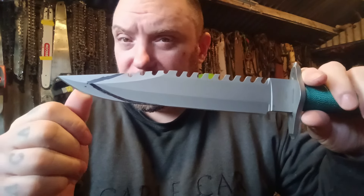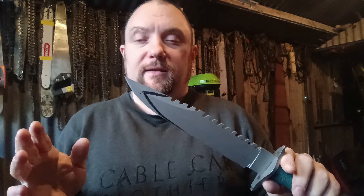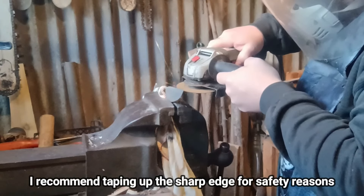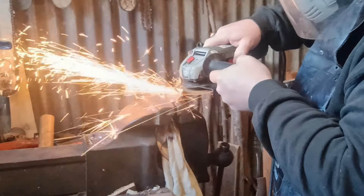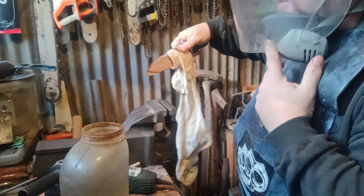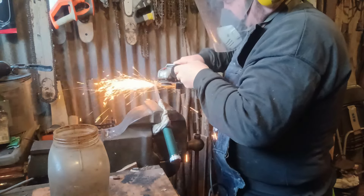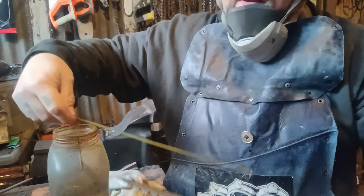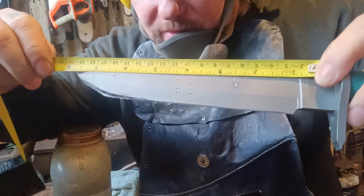What I'm going to do now is cut this with an angle grinder, and then using a simple belt grinder put the edge back on it — then it'll be perfectly legal. Don't forget to keep the blade cool as you go so you don't completely mess up the temper. Okay, so from the guard to the tip, that blade is now under eight inches long.